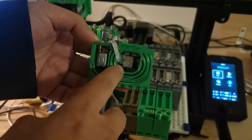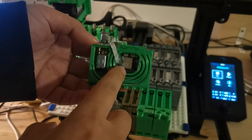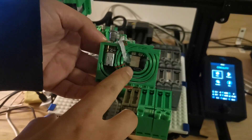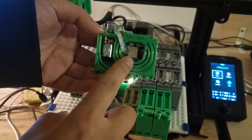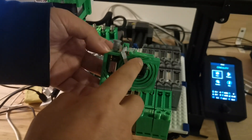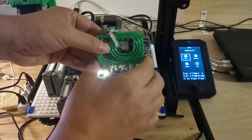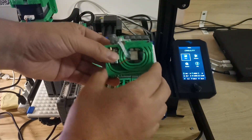This feeder uses an ESP32C3 as the main chip. It also comes with Wi-Fi and wireless functionality, but so far because of power consumption concerns I haven't used that function. However, it's possible to use the Wi-Fi function — for example, to record how many components have been placed. There is a lot of functionality that could be used with this chip.